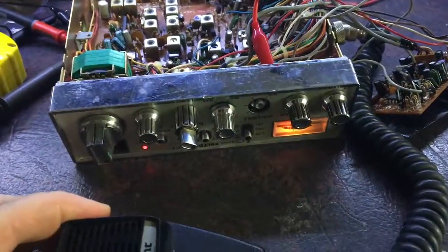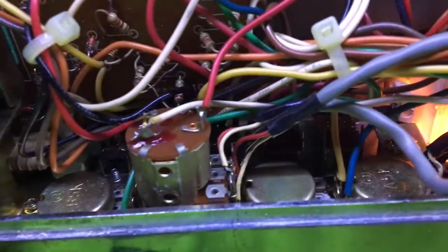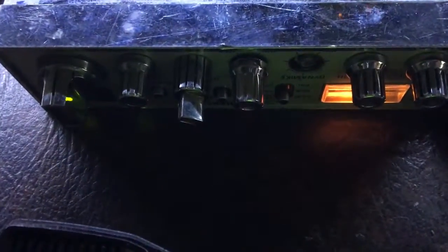Turn that back off — no audio. So the actual radio is working, but the modification board isn't. I hooked up the wave generator to the center pin of the mic gain control which comes out of that modification board, just to rule out the pot. Sure enough, I had no audio. The pot is broken — snapped inside — so it won't work. I have to replace that.